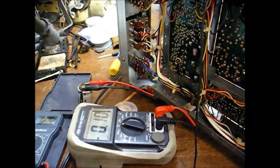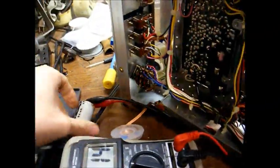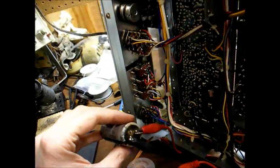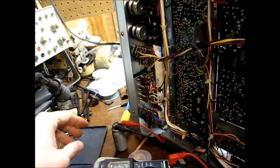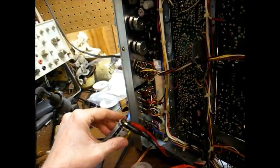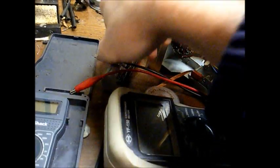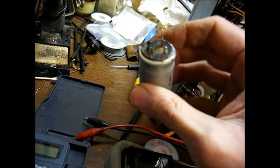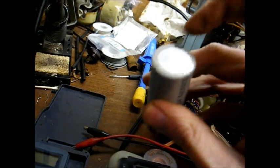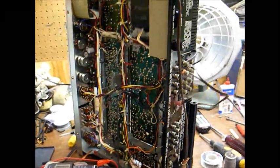I'll end this video now and I'll make another video once I get the correct parts that I need, and I'll show it to you again when it's up and running properly. Thanks for watching and more to come later. Apparently this old capacitor had an intermittent connection inside, because I was able to wiggle it the first time and the hum would go away, but re-soldering it didn't solve the problem — it actually made it worse, so that tells me this cap is intermittently open. If you look here, it looks kind of cruddy on the bottom — some of that's probably glue that held it to the PC board, but it looks a little swollen. The top feels like it's trying to swell up a little bit. You'll see this again when it's up and running. Thanks for watching and more to come later.